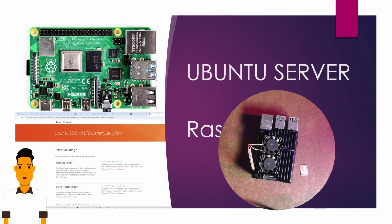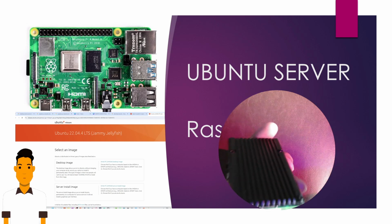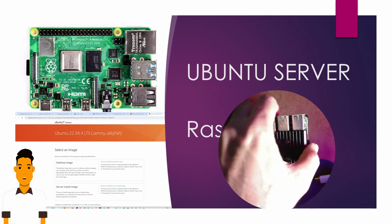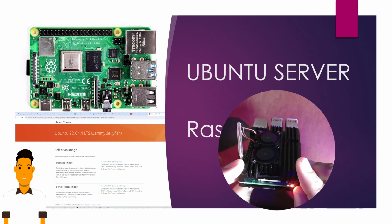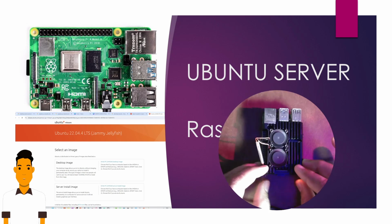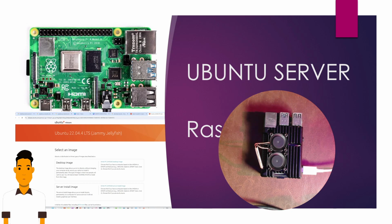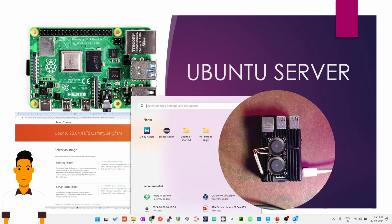Now the next thing that we will do is insert the SD card into the Raspberry Pi and then power it up. Now you can see that the green light is flashing over here, and we'll just wait for the boot process to get completed. Now we will launch the PuTTY application and see if we can remotely log in to our Ubuntu server.